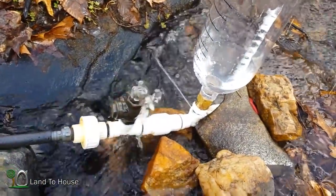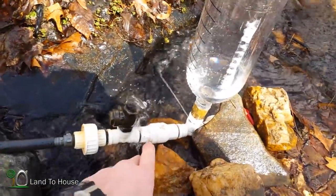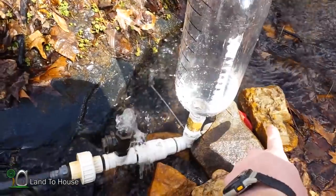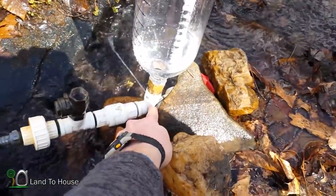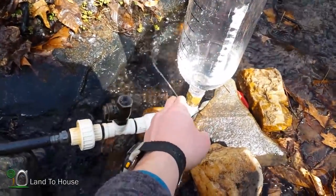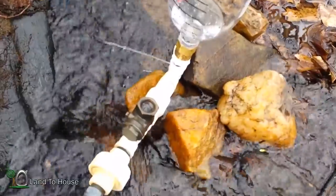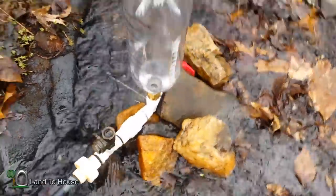The reason I was testing this out — I pretty much knew it was going to happen. In the other design, the waste valve is on the other side of the pressure tank, and wherever you put this in there it actually allows an air bulb to come up without losing pressure. Just as I had predicted, putting a hole caused the pressure to drop enough for the valve to close and not open again.